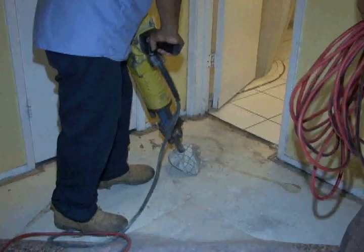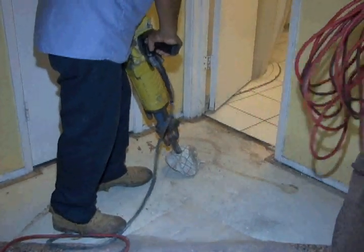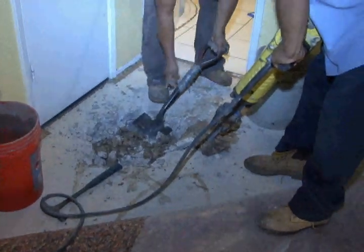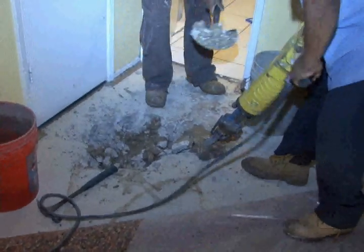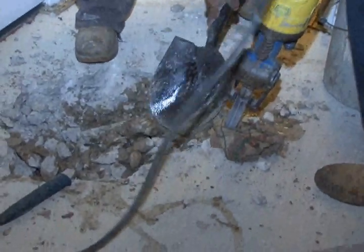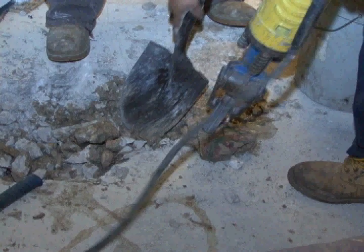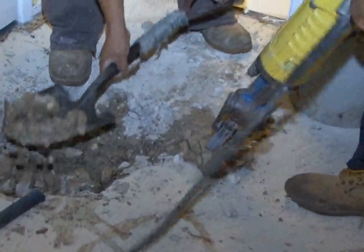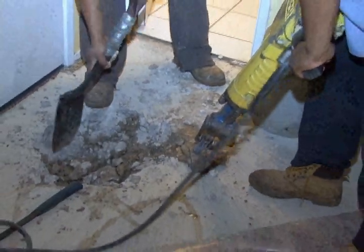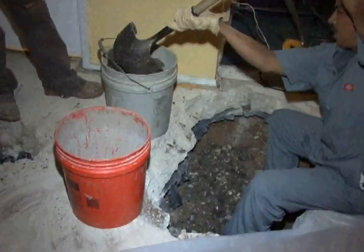What they were doing there is jackhammering through the floor to get ready to actually tunnel. He's taking the concrete — the old concrete — out from the hole. Continuing on with the jackhammer, you can actually see there is an old towel that we're using there. We wet it and use that to keep the dust down while we're actually jackhammering.